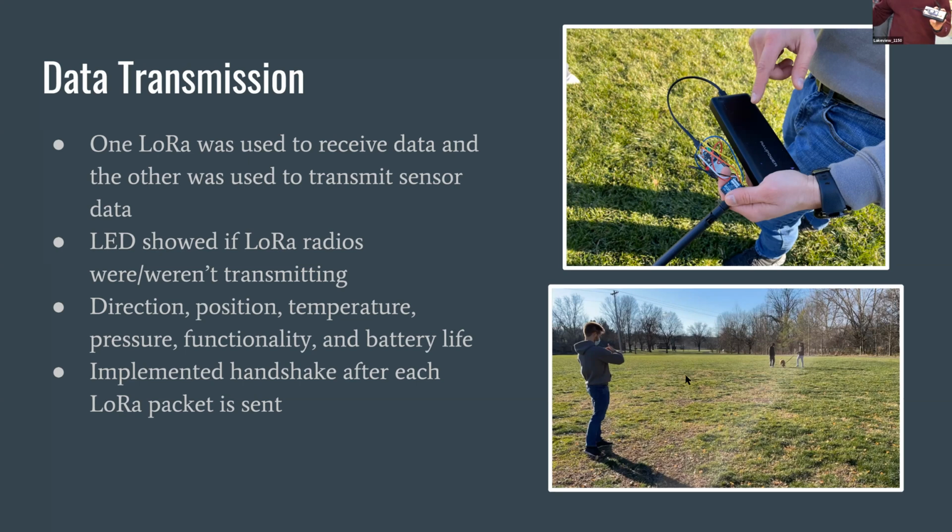So if I turn off Wi-Fi on my phone right now, I can actually go ahead and do that. Then every time we receive the LoRa messages, we won't be able to forward the message further on, so the yellow LED flashes, because there's an HTTP code other than 200. So now that Wi-Fi is off, next time we have a message, which should be in the next 5 to 10 seconds, there you go. I can see the yellow flash. I don't know if you caught that, but there was a yellow flash. And there it was again. The yellow and the red flash together. The yellow indicates Wi-Fi. So if yellow and green blink together, that's a successful Wi-Fi code. If yellow and red blink together, that's a Wi-Fi issue.